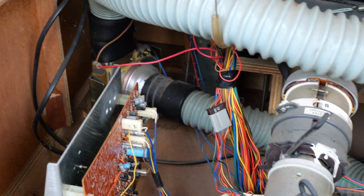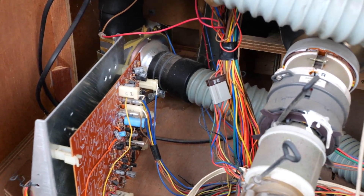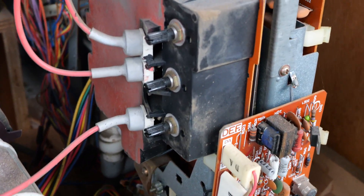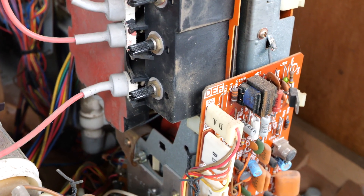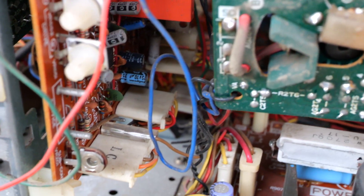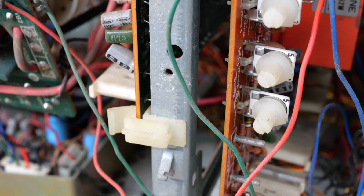I wonder if that fan-induced cooling system is powered — I don't know exactly where it draws the cool air in, but it's quite a marvellous setup. And there are your voltage dials for the flyback transformers, I would say, unless it's focus — that's possible too. There are even some pots down on this board: screen voltage, drive, blue drive, green drive — cool stuff.